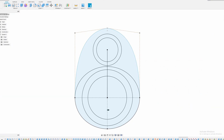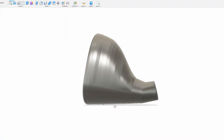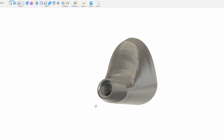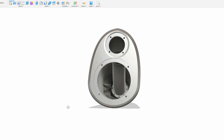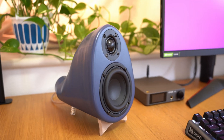The speaker enclosure I designed in Fusion 360. Starting out, I only had a rough idea of the baffle shape, which I tried to extend in an organic way to complete the speaker. Because I am using a 3D printer to create the enclosure, I avoided planar surfaces as much as possible. The result is a tapered shape slowly merging into the rear part of the bass reflex. I am really happy with the overall aesthetics. With a program called WinISD, I could also calculate an appropriate port diameter and length to optimize the bass output at low frequencies.